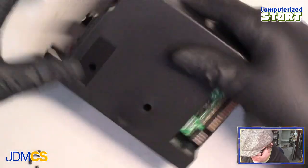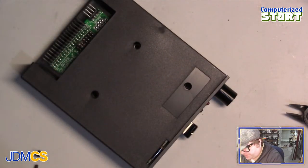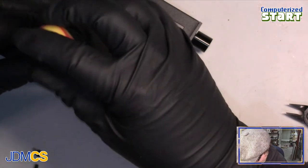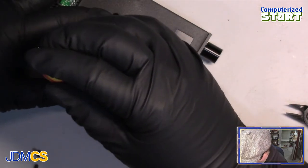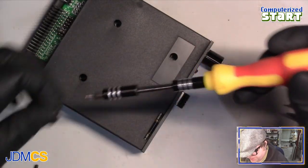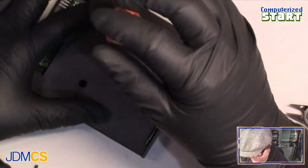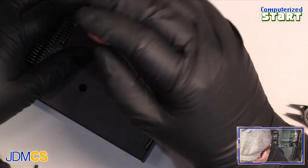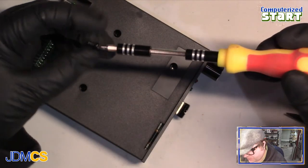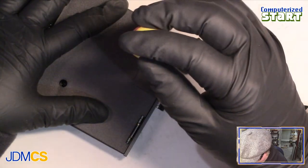And then I think the one that I bought off eBay where the image starts to get unstable right away, I think I might try recapping it because I don't think I recapped it. I'll have to check though. I think one of the cards I've had actually had all tantalums on it. I don't remember which card it was. And if recapping it doesn't work, I'm going to swipe the crystal off of one of those cards and try replacing the crystal, because I'm thinking the crystal might be going bad. On that card, I think the RAM DAC also generates the clock for the video signal. My suspicion is that maybe the crystal's failing and the RAM DAC's not getting a proper signal, so whatever clock signal it's driving is wrong. But anyways, that's just a preview of my suspicions.